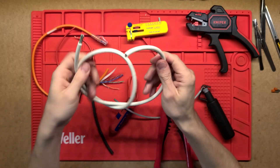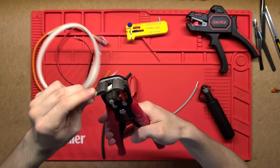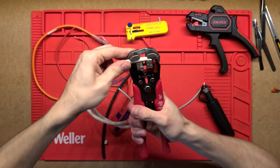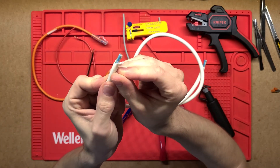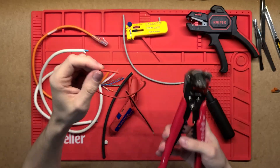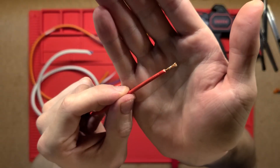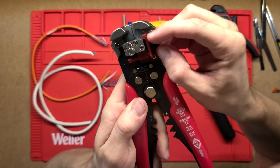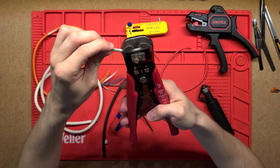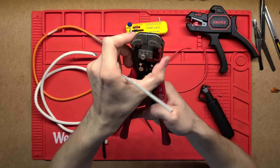This is fairly versatile — you can use it for a bunch of different thicknesses of cable. This one might be pushing it but it should still strip a little bit okay. That's probably about its limit; it's not really going to do that all too well. You're better off using something different for this, but when you are stripping smaller diameter cables it's very nice and easy and gets a really clean strip. It also has this little arm here that you can move in and out, so you can strip a very precise length of cable — it acts as a backstop. When you push the cable in, it'll always stop there so if you do multiple strips, you can always strip to the same length.